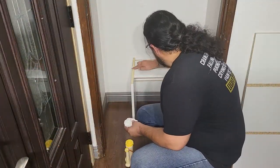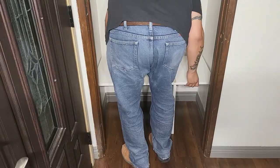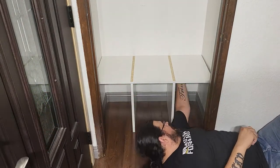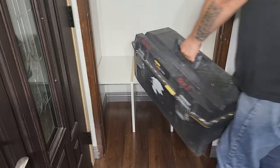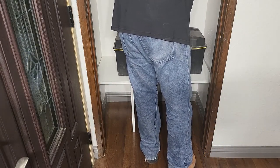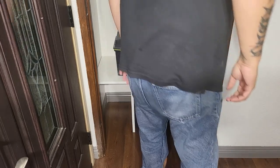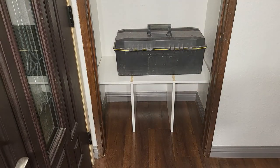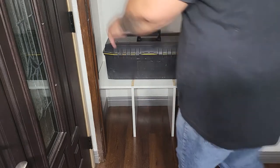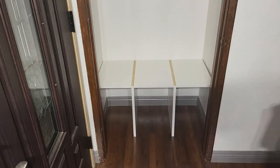Particle board is extremely porous, and I knew it would absorb a lot of the glue, so I applied it pretty generously and then installed the lower shelf onto the base. There wasn't a lot of squeeze out, as I suspected, and I cleaned up what there was with a damp cloth. I always have a damp cloth on hand when I'm gluing anything up because it really is the best, most efficient method of cleaning up excess wood glue without leaving any residue that can wreak havoc on your finish. Finally, I used a toolbox to put some pressure on it as it dried. After an hour or so, I removed the toolbox and put the center cabinet into place.